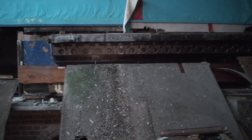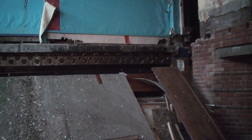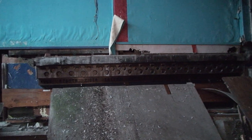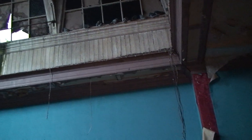Now, some areas of the roof are very bad and will need a lot of work, even to make them temporarily repaired. Before we could get on the main roof at the top of the building, we had to shore the roof up. To do that, we had to shore up all the floors below it.